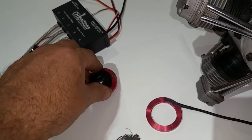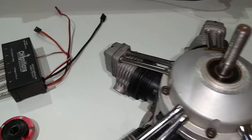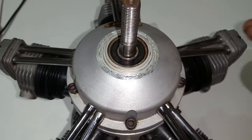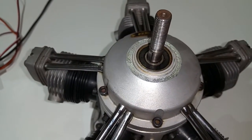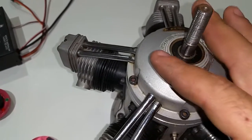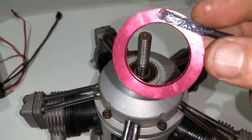I'm not gonna do the bolt-on approach — I don't like it, it gets too big and defeats the scale working part of it. Bill Carpenter, for the last 30 years, has been using JB weld in this type of application and never had an issue. So on the engine — and the same applies to the OS and the three-to-five — you rough it up a little bit so the JB weld gets around it and sticks better to a rough surface. The ring itself has a little lip that's gonna snap on the outside.